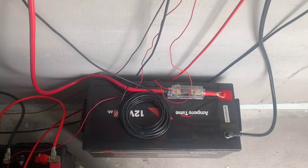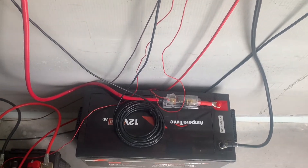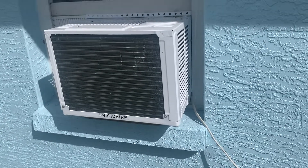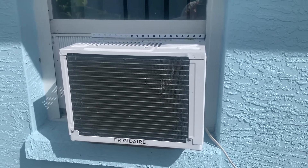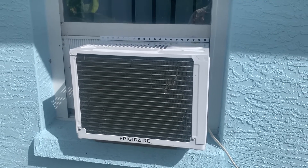This is all you need, plus the solar panel. I just wanted to clear that up, as some people were getting confused. This is the window unit air conditioner I'm running — it draws about 400 watts during deep cooling, about 87 watts when it's just running the fan to maintain temperature, and about 3 watts when it's in standby.